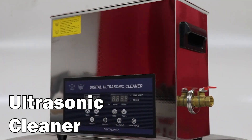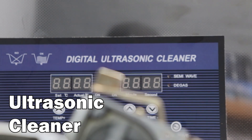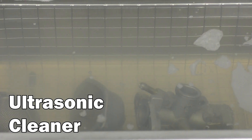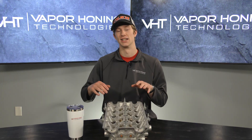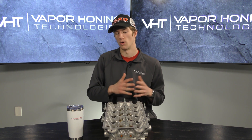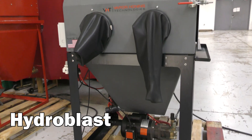Another tool you can use to help rid your parts of abrasive is an ultrasonic cleaner. The high vibration caused by the ultrasonic cleaner is very good at dislodging any abrasive inside your parts — it suspends it similarly to a dip tank and helps it settle out. They're more expensive, but they work about as well as a dip tank and are hands-off, so you can increase your rate of processing parts.